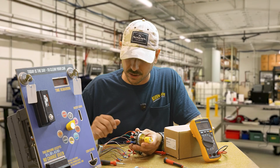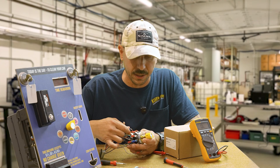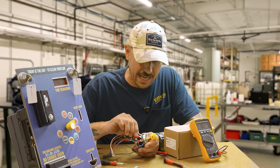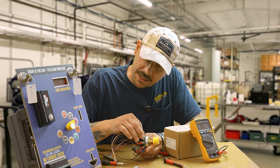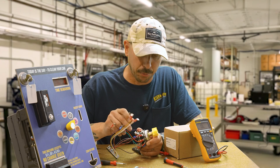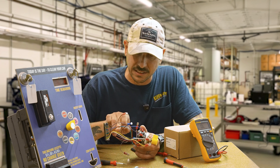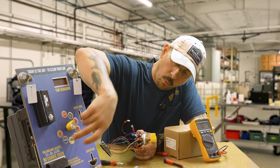The next function is high pressure soap. Here's where the second stack comes into play. I'm going to take that pump contactor wire — the brown wire — and land that on the back stack to trigger the pump to run, and I'll land the high pressure soap solenoid wire — the red wire — on the front stack. Next position is foam brush, which is purple. Then high pressure rinse — as everyone has probably guessed — is blue, signifying the color of water. I'll slide that rinse wire on the front stack.